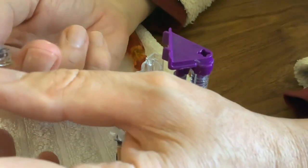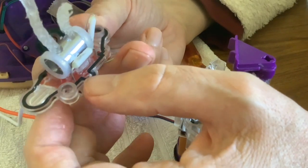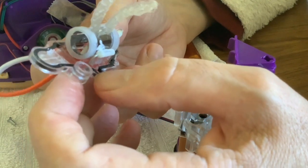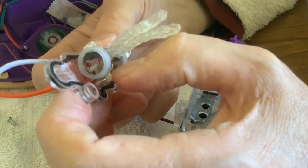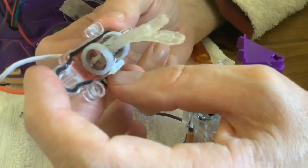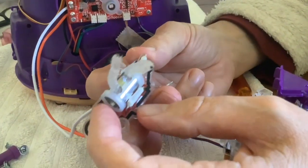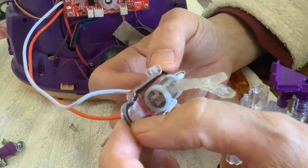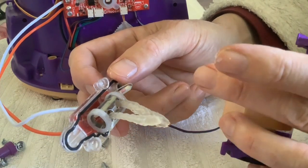It's quite an unusual mechanism to have in a toy because you're using quite a bit of battery current with a heating element - that's unusual in itself. I think it takes a lot of batteries, six batteries possibly. But the idea of having a heating element inside a child's toy seems unsafe - of course it isn't; it's been well designed, it's in this metal shroud, controlled by the electronics, and it's got these two thermal fuses. So if anything went wrong and it were to get too hot, it would cut the power off. There are lots of black seals everywhere to stop the glycerin getting out, but unfortunately it has leaked out of the chamber in several places.